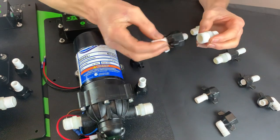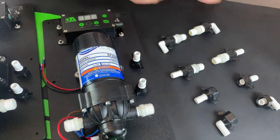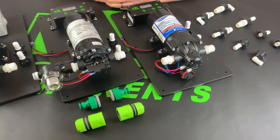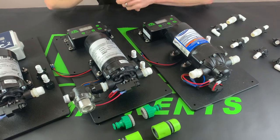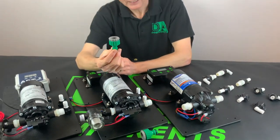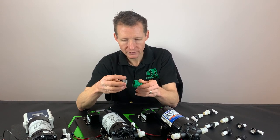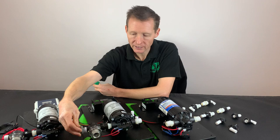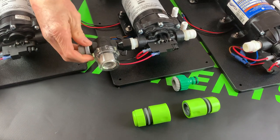Then you attach your plastic straight or bend connector as desired. However, if you don't have any spares and something's fallen in your van, or it's cold temperatures and one of these wing nuts breaks and it's all leaking, you can also nip down to your local DIY shop — B&Q or similar — and you will need a tap connector with a tap reducer. It comes in a kit like this. The key part is that this is exactly the same thread size as the inlets and pump filters on the control panels, and it threads on just like so.